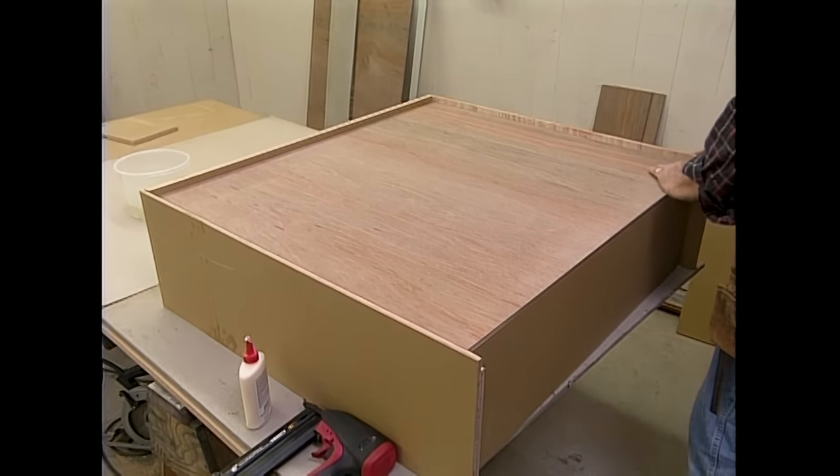I've notched the ends of these pieces to fit inside the dado, and I'll just glue it and attach it with some brads. While the piece is still up on the workbench, I'm going to attach the door hinges and the drawer slides. These are full extension slides — just a few screws into the side of the cabinet. Some more one and a half inch wide pine will cover the edge of the countertop and also provide a place to clamp a tool down. While I've still got the cabinet up on the bench, I want to install these plywood blocks underneath the cabinet — it will give me more wood into which I'll be able to set lag screws, which will secure these locking casters. Just apply a little bit of glue and nail them on with some brads.